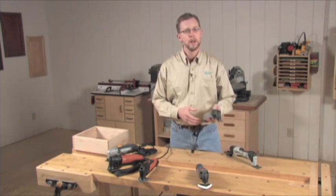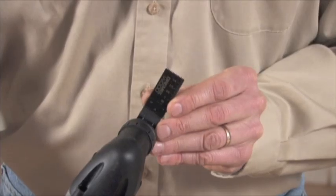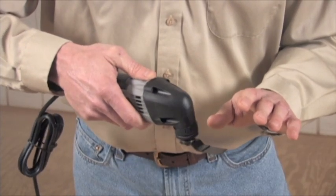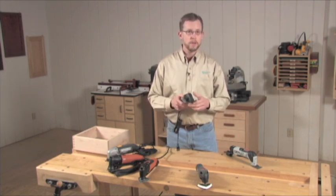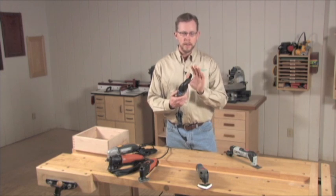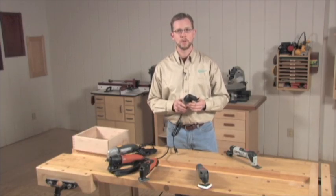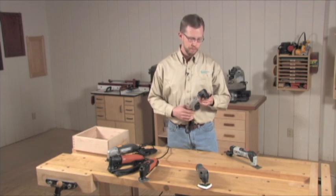Or maybe, for instance, you're laying a new hardwood floor or wanting to put some outlets in your walls. Well, with a multi-tool and an end cutting blade with teeth on the end, you can use this tool to get right down close to your flooring so you can undercut those door casings and take a half an inch or so off of those moldings at the bottom without damaging the surrounding woodwork or walls or your subfloor. And part of the advantage again is that fine oscillating motion of these tools doesn't introduce any rotational motion that you get with circular saws or routers, so there's no danger of kickback with a tool like this. It's a very fine motor control and a very safe tool to use as well.